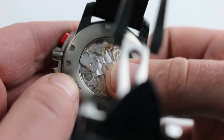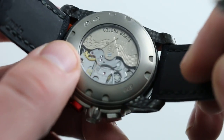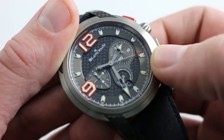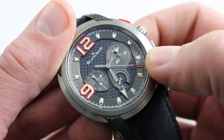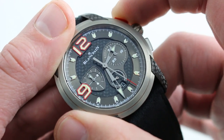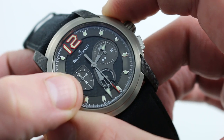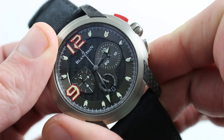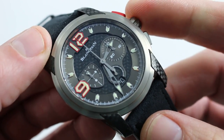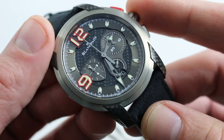You'll also note the crenelated and polished column wheel just below my thumb — this is the function selector of the movement. Underneath the winding bridge there is a vertical clutch mechanism which enables the watch to run continuously; if you like center seconds, you can leave the chronograph engaged without any hazard to the movement. The advantage of a vertical clutch is the ability to start the chronograph without any kind of jump and stop it without stagger, and it always resets precisely to the index of twelve — the advantage of not having meshing gears as part of the system. The watch also features a robust screw-down crown and 100-meter water resistance, so that 40-hour power reserve automatic chronograph is well protected.